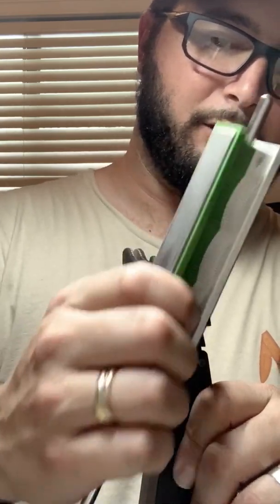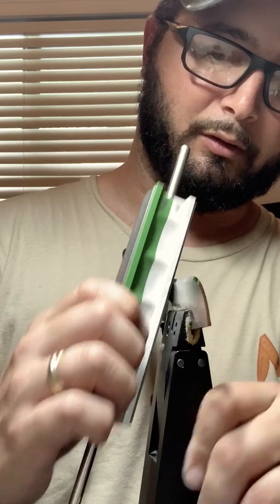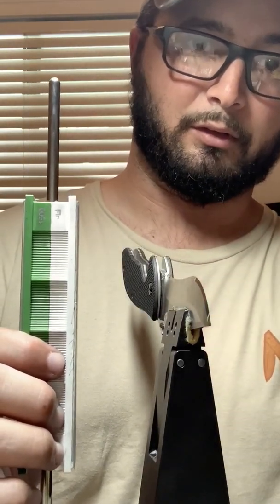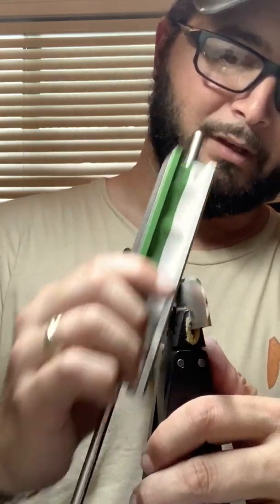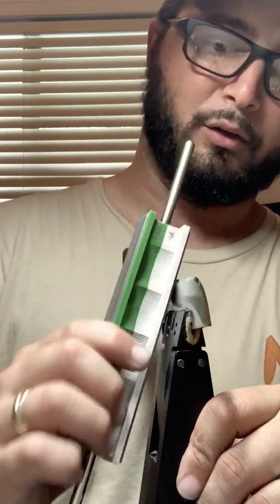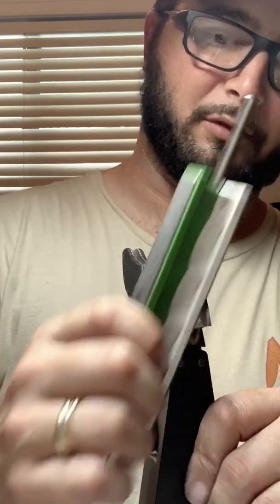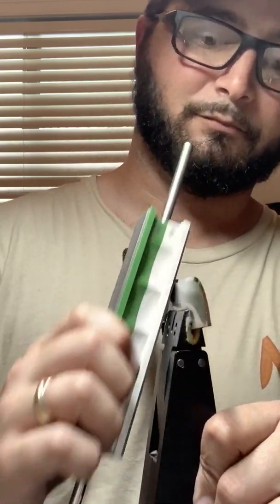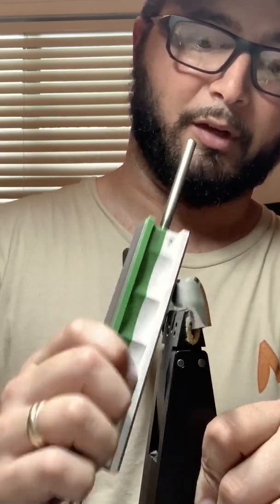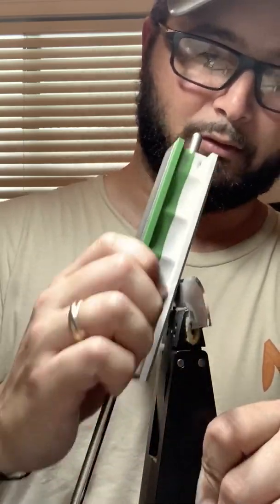On recurved knives and tantos, you've got to be careful on the lapping films, because the change in shape of the edge, so it does a little swerve, will cut off some of the lapping film. And you definitely, well, for one, you don't want to cut off your lapping film because they're expensive, and two, if you were to cut deep enough, you don't want your freshly sharpened knife to hit the glass platen and then have to start over and fix the damage you just caused.